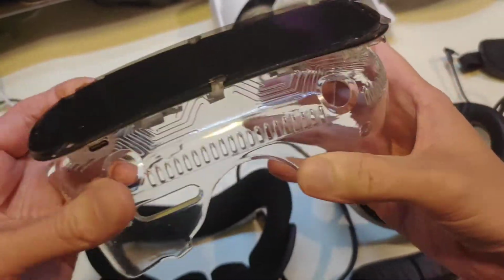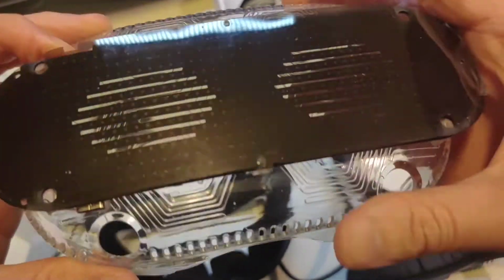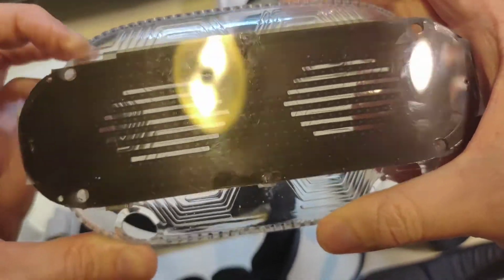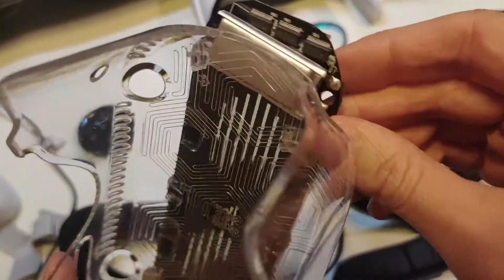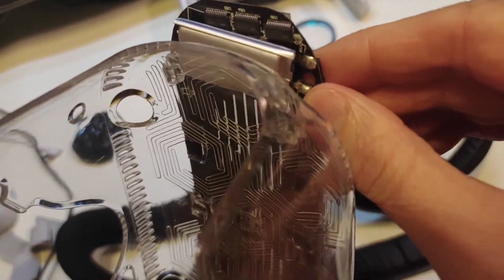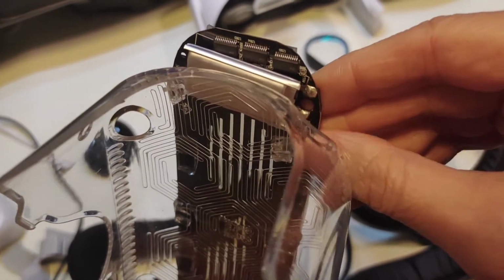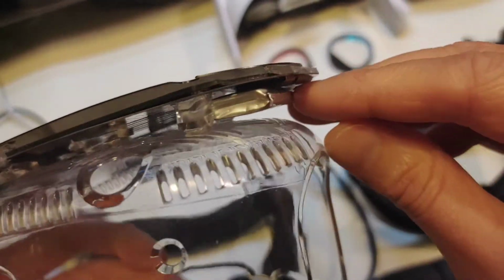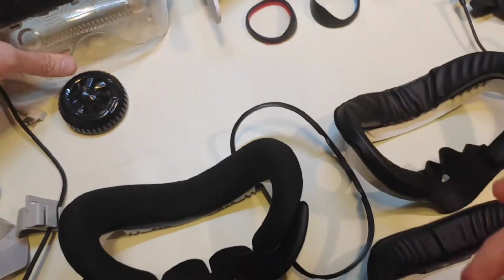See, it's where I've got the battery just disconnected. The power button doesn't work without it being plugged into the headset. Now, the battery connection here is really simple. All I'd have to do is just resolder this connection right here and this connection right here. But this keeps the battery from getting explodey on me while I'm wearing my headset.